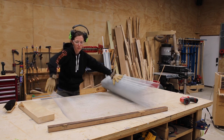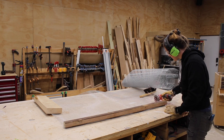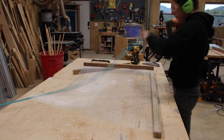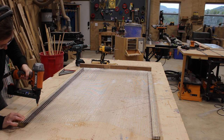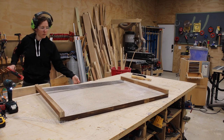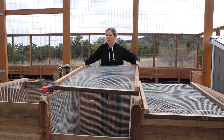One last component and this project will be a wrap. In order to keep animals out, next I build some lids. These are pretty simple construction with some 2x2s and more hardware cloth. I built these inside my shop because it is way easier to do on a large flat surface. I started by attaching the cloth to one of the 2x2s, then flipped it over and attached the long side to the short side, then repeated on the remaining two sides. To attach the lids to the stalls I screwed on a few hinges to the back of the body, then set the lid in place, lined it up to the hinge, and secured it with screws.